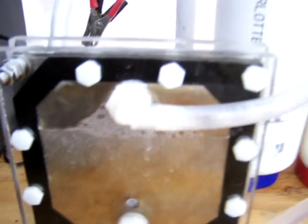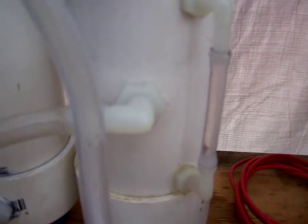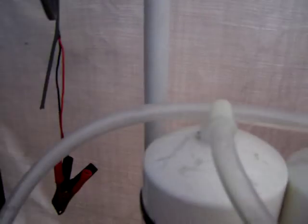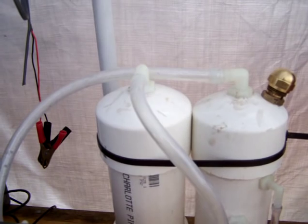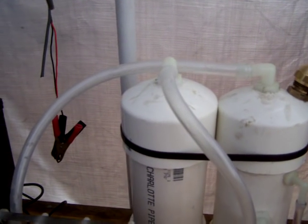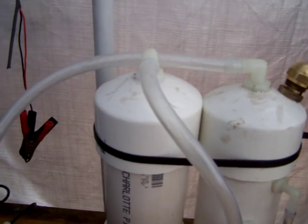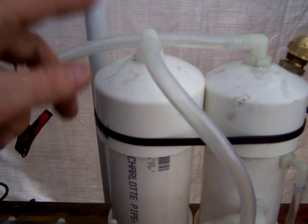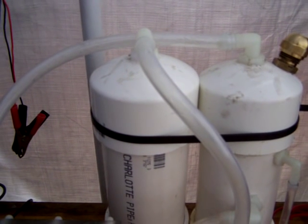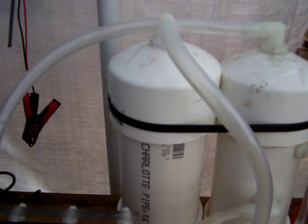It's both hydrogen and oxygen gas combined. You can see the generator feeding back into the reservoir, which acts as the primary bubbler. The gas comes up, out, and then goes back into the bottom of the secondary bubbler, also known as the scrubber. The purpose of that is it cleans any impurities out of the gas and cools it down a little bit more. This will also act as a flash arrester — if for any reason the explosion comes back down the lines, basically this cap is just going to pop off.